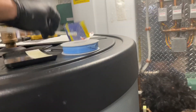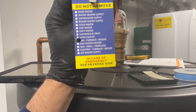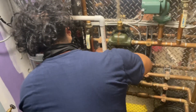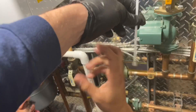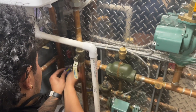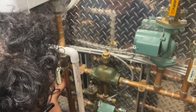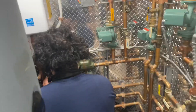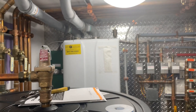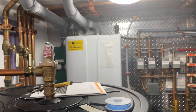Okay, this one should be much easier — the gas. Yep, gas furnace, boiler. There's the next one for you. There we go — three-quarter inch gas coming to the Navien, and the valve is right above it. We got the sticker, and we got our combustion and draft analysis printout. That's how we finish a job. If you ain't checking, you're guessing.